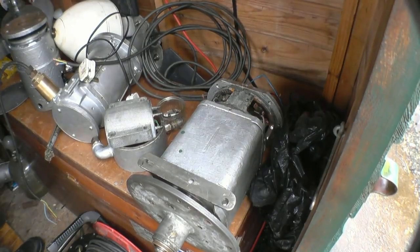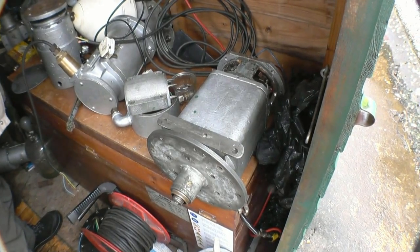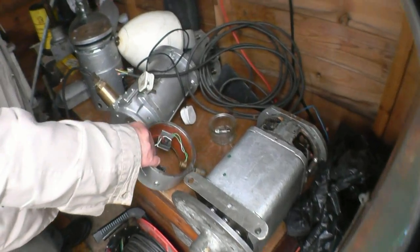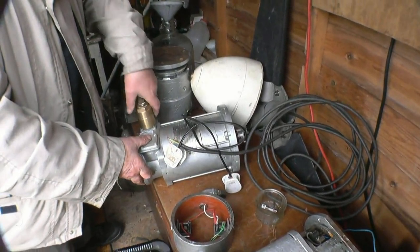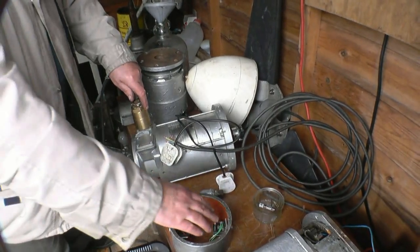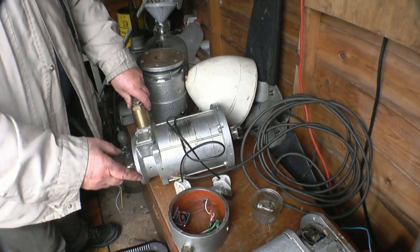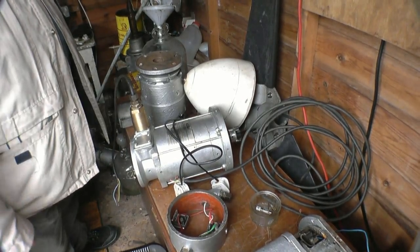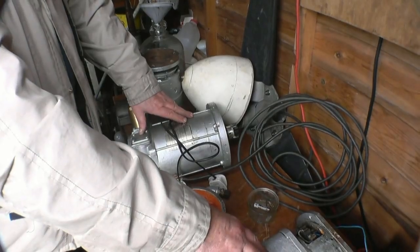You've got the other part of the hub there and you've got your three blades on it. It's upside down and the generator is between these two — that bit goes in the middle, and this is the AC generator, the alternator for the low wind, and that's coupled. Your connections go through the cable glands and all your diodes are in there. So that puts the AC out? It's AC but it's rectified before it comes down — 24-volt DC.